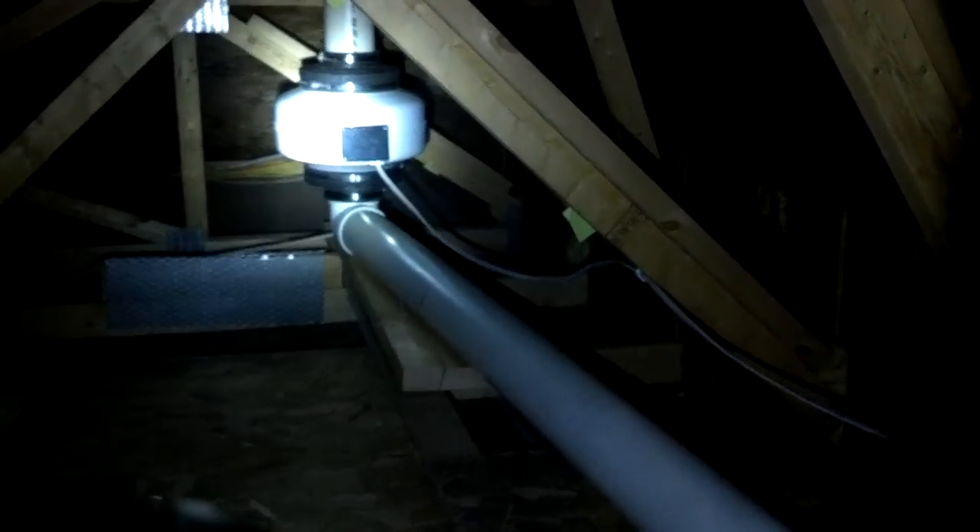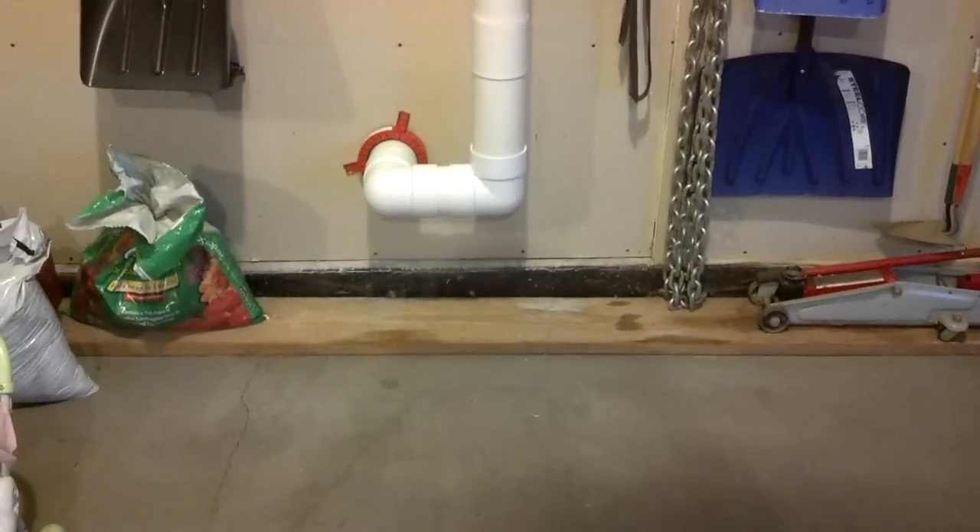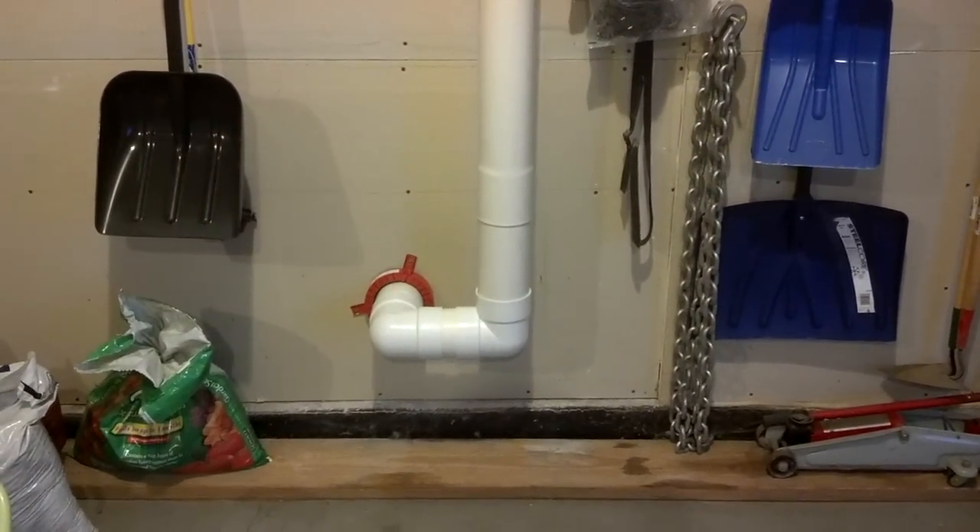Now we've got the cozy boot installed. We've got a pitch to this so the water can drain all the way back down into the sump line if it needs to. The fan is hooked up — I've got the Romex running all up to code into a switch, the switch into the breaker, and it's a 15-amp breaker. At this point everything is installed. These cozy boots work great — they seal up really nice and can always be removed just by unbolting them and popping them free. Highly recommend those for putting one of these in your roof. I did follow code and installed a fire gasket ring because this goes into my house — if it gets to a certain temperature that thing expands at 600% and seals it off.